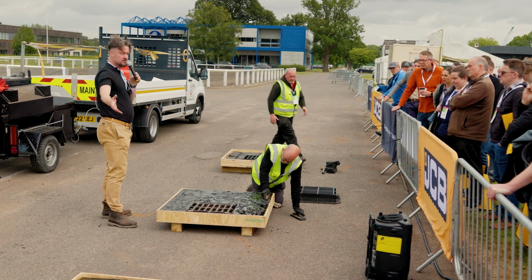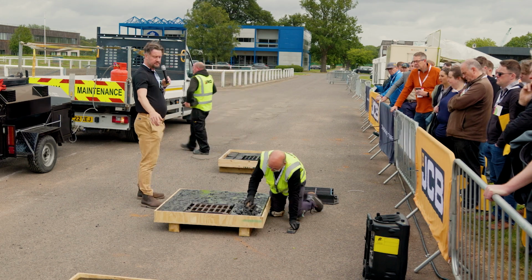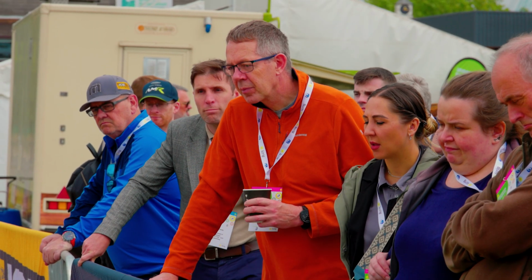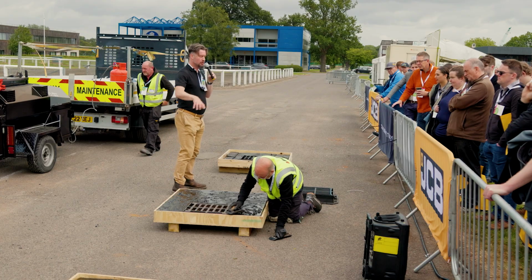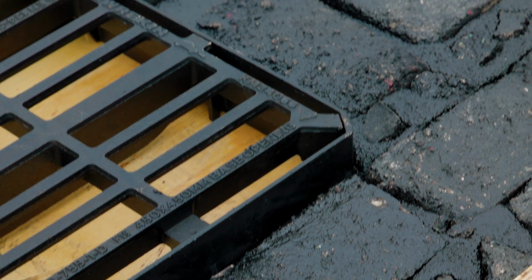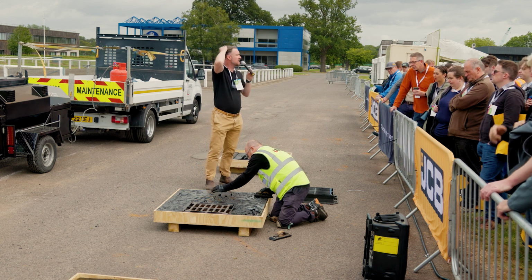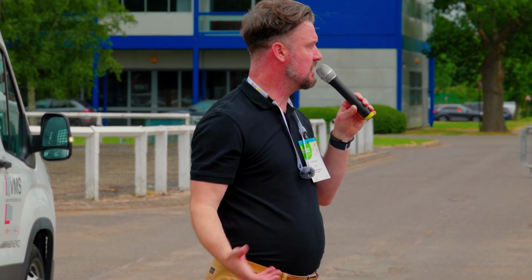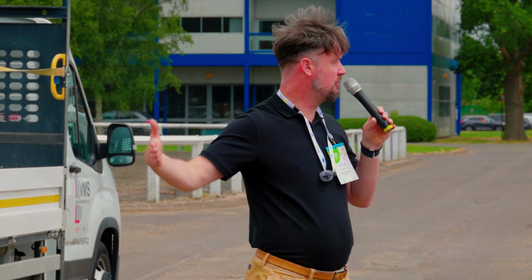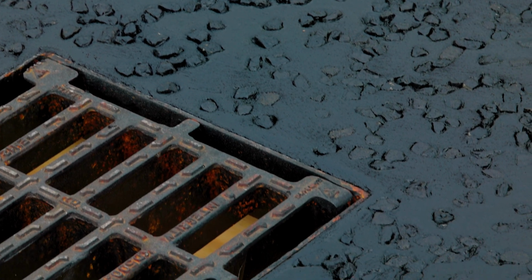So these rigs are, relative to a gully, very big, but it's just so everybody could see fully what we were doing. But on a live site, in practical terms, yes, you'd see a 250 mil band. What it can also do is, if you've got multiple services with, say, 150 mil spacing or some narrow spacing, because it's not a compactable product, it's easy to do because it flows between, and you can do them all in one. So if you've got multiple covers, you could do them in one large Pacopatch patch, and link them into the edges.